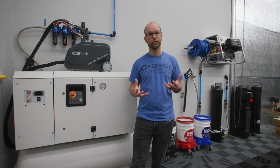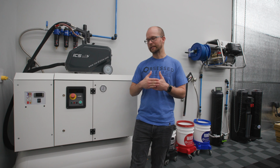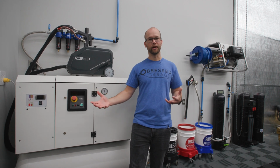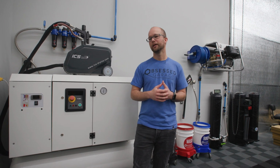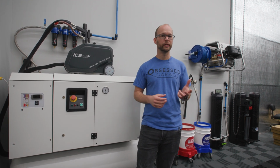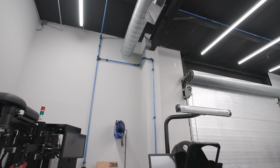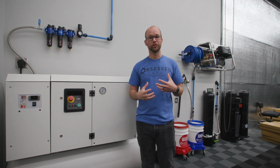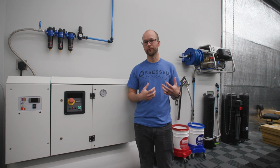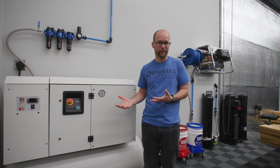So this is really the first question that we always ask to get the process started, because this leads the way for everything else: selecting your compressor, figuring out how many air reels you need, how much Prevost you're going to need, how big of a system to do, and how much CFM and pressure and that sort of thing. So answering what you're going to be using compressed air for will help determine the answer for the next question, which is, what compressor do I get?